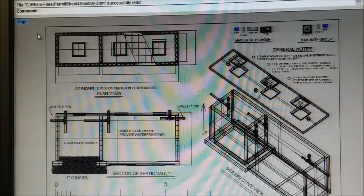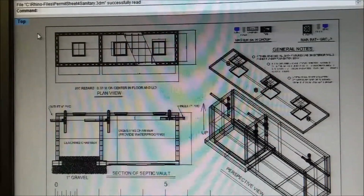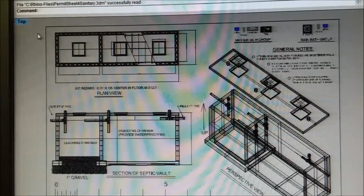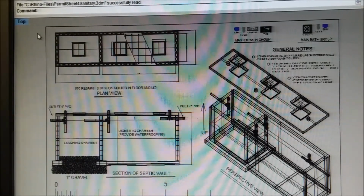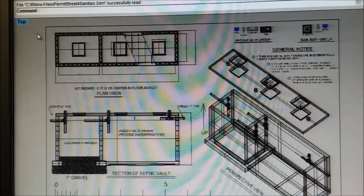Septic tank digesters require oxygen. You have to have vents. Now this one is drawn here with 3 small vents out of the lid of the tank. You'll notice that there are 2 of them, 2 vents in the first section, an in and an out. The vent for that septic tank will not look like what you see in this drawing. They have to be at different heights.